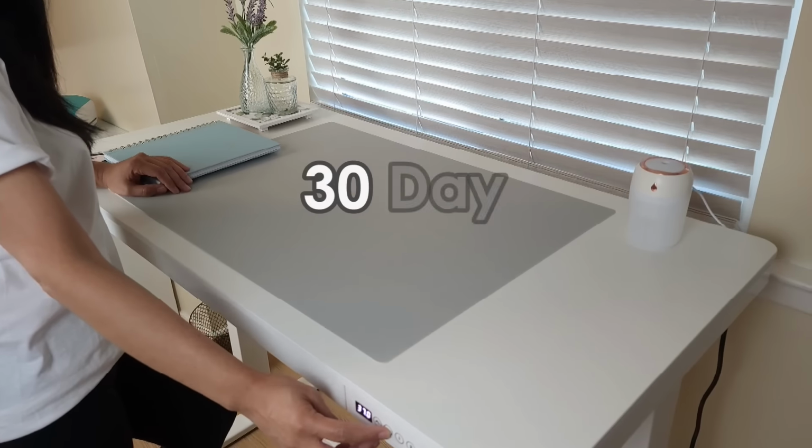I'll be using 2 feet of this 1 by 2 inch wood board and 2 5-gallon paint stir sticks. I'm going to cut the 1 by 2 in half and the paint stir sticks to 12 inches as well. Before I stain it, I take note of the areas where I will be applying glue, and I make sure to avoid those areas.